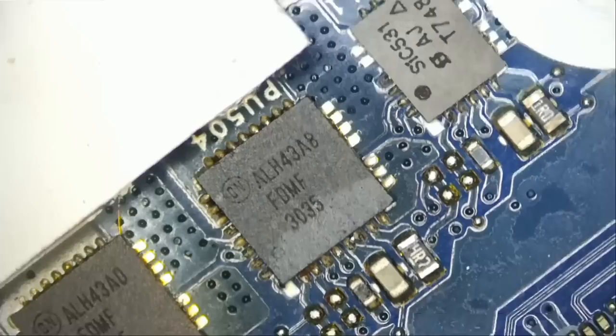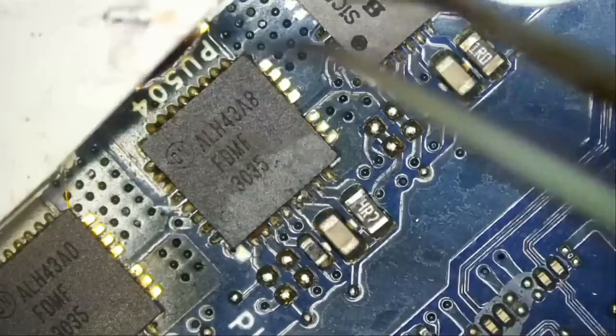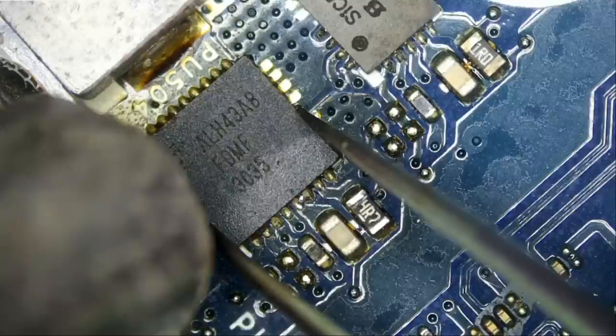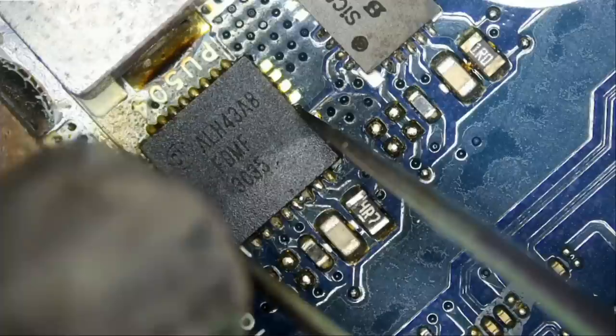Let's go ahead and remove that chip and see if that will get rid of the short. If yes, great — we will replace that chip and hope for the best. We can remove this thermal pad for the time being; it's sitting over the inductors. Let's remove this chip. That board is thick — it's a multi-layer board. I do not know how many layers, but the board must absorb all the heat before solder reaches melting temperature, and then we will be able to remove that chip.